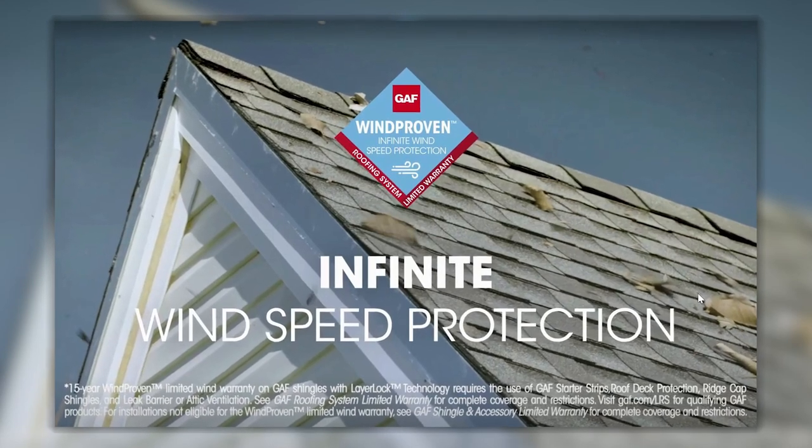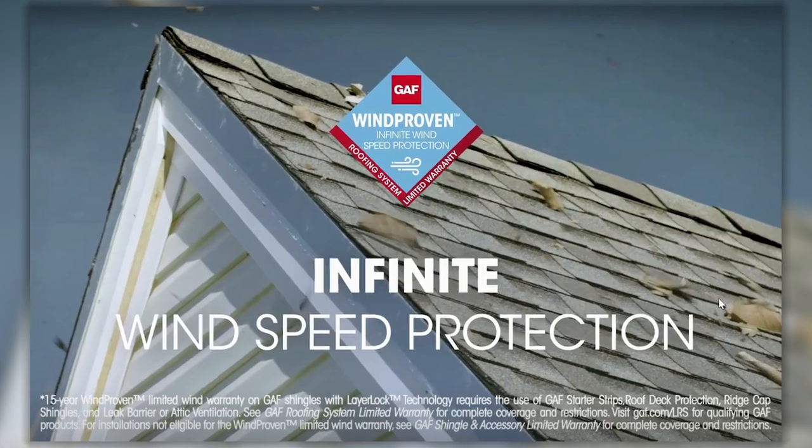For the past few years, CertainTeed, one of the biggest roofing companies in North America, has also offered a high-end architectural shingle, the Landmark Premium. Similar to the UHDZ, the Landmark Premium has added weight and supports an enhanced colored granule blend that increases the definition of the shingle. CertainTeed also has an algae-fighting technology known as Streak Fighter. That being said, GAF's warranty for algae resistance is far greater — up to 30 years with the UHDZ — while the Landmark Premium only carries a 15-year warranty against it. Wind resistance is another area where the UHDZ leads: CertainTeed's shingle carries a 15-year warranty for winds up to 110 miles per hour, while the Ultra HDZ shingles have no limitation on wind speed for their 15-year wind-proofing warranty.